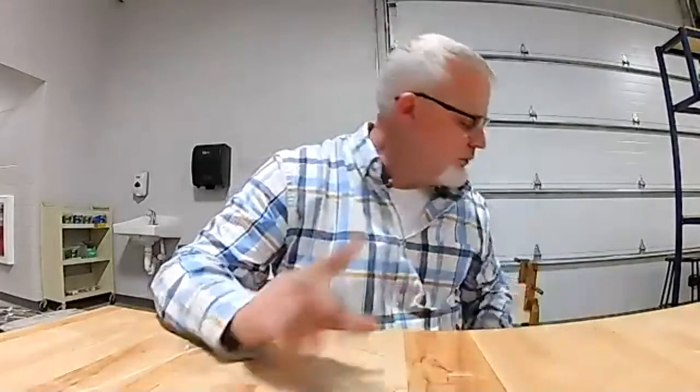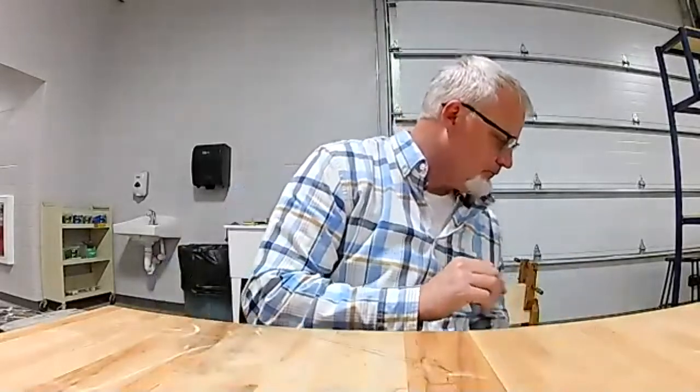A lot of gym floors are polyurethane treated, and that's why you see an older gym floor and it's really dark yellow. It's yellowed over time. Even when they reapply, if they don't sand off the entire previous coat and they coat over it, it's still going to be very yellow. It just gets darker over time. So that's what I don't like about it.